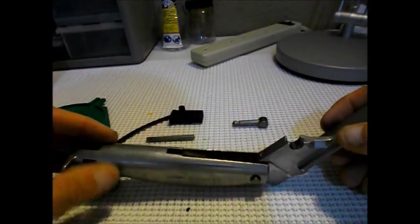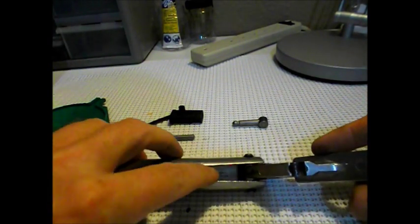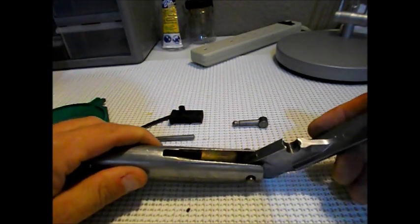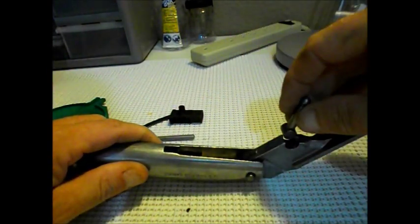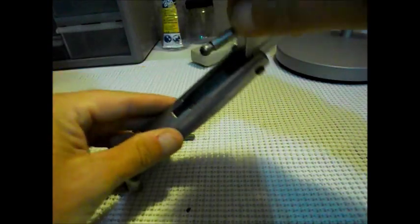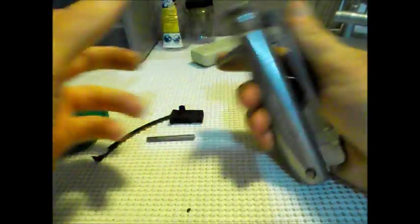Okay, now that we have the press disassembled, let's go ahead and reassemble it. As you can see, there's the receiving arm, the lifting arm, that actually comes in contact with this pivot arm that forces everything up. So you install your pivot arm, lean it forward, place it into the press, make sure you get in contact with that, lift it forward so you know you have good contact.